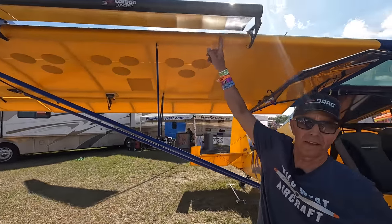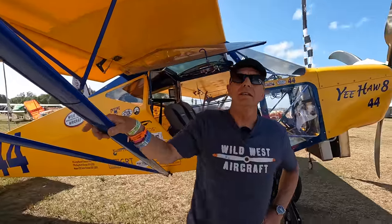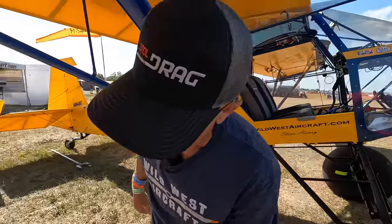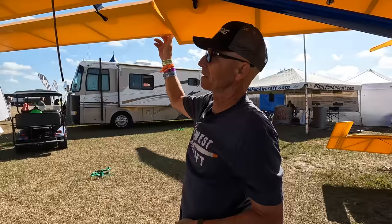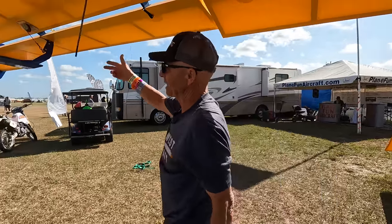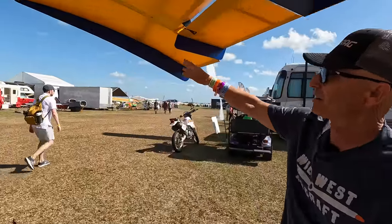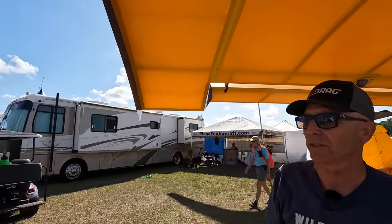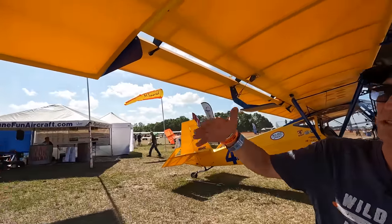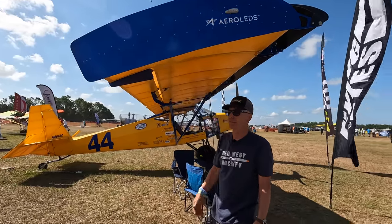The cuff — I think anybody with a Highlander ought to put the cuff on because it's only $500. It's not hard to do and it really does help that Highlander wing. We also put a different leading edge on our aileron — it just makes the ailerons work a little better. At times I run a spade. The reason I have them on right now is because I have an extra 18 inches of wing on here — that's just a competition thing. The only time I run that is if I'm doing a stall competition. That's going to make the roll rate a little slower, so sometimes I'll put the spade on to bring the ailerons back.